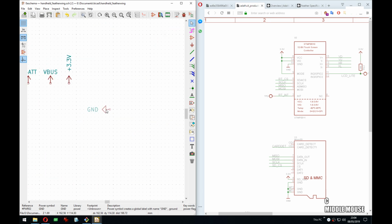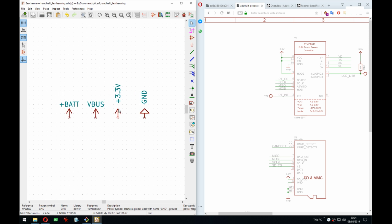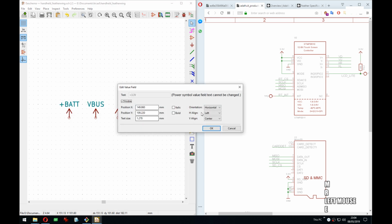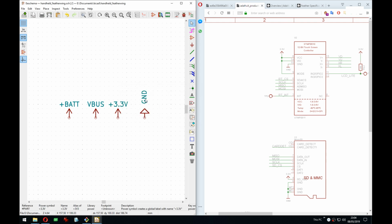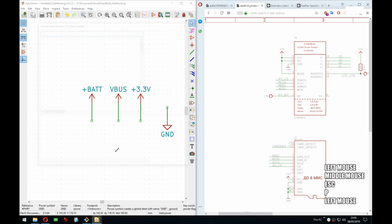Also power, for some reason, it's a flag. So that means all the pins that will be connected to 3 volt are inputs, like there's no output for 3 volt, and the power flag marks it as an output. That way ERC can be happy that, okay, 3 volts does not come out of thin air, or if it does, you mark that you are aware of it. So basically it just tells KiCad to shut up.